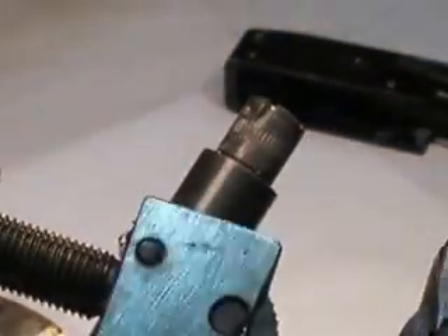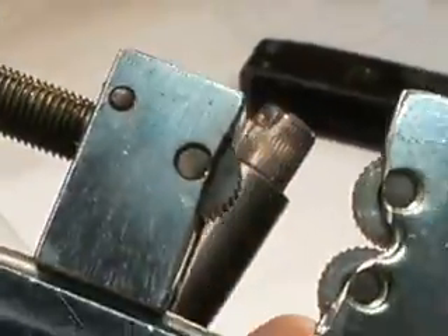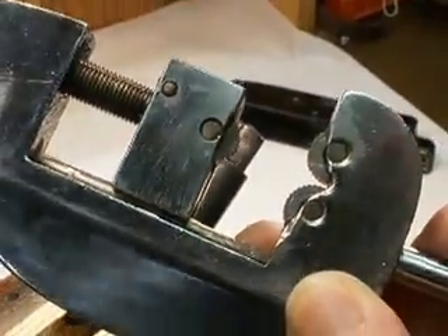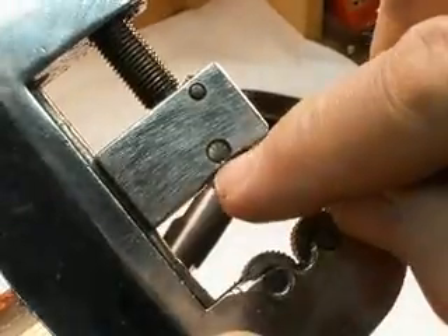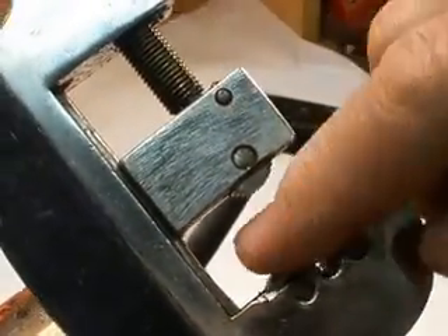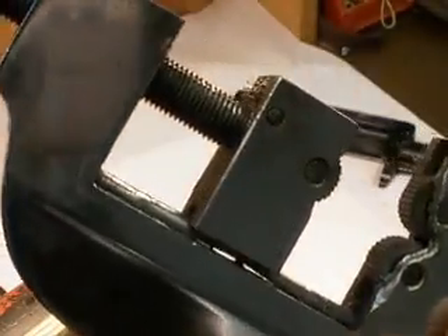This is how I modified the tool. I ground this away right here so you can get the maximum closeness to the edge of the barrel and the receiver.